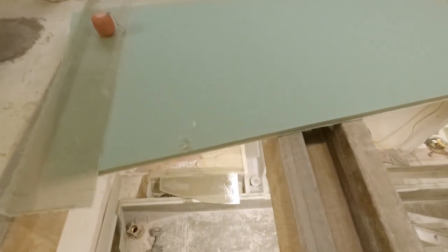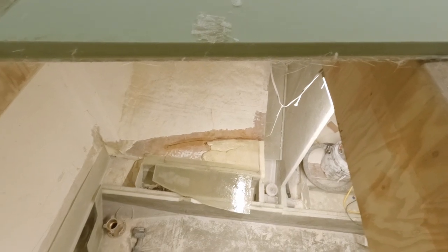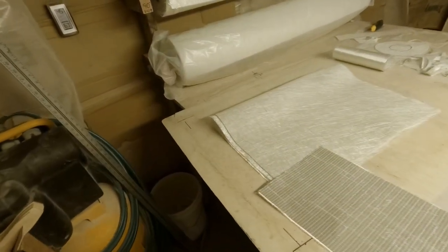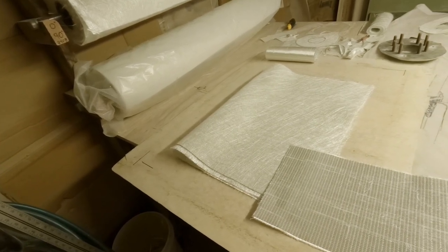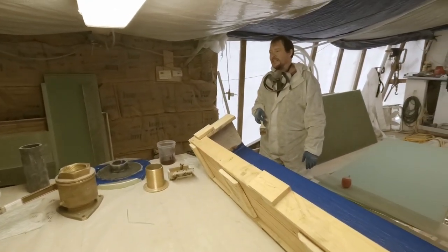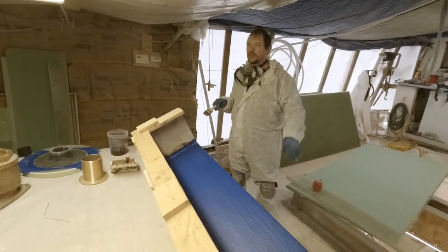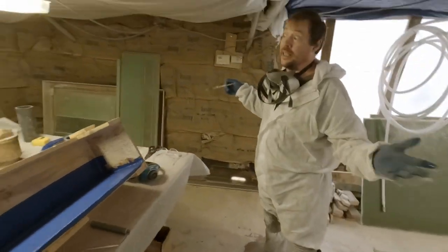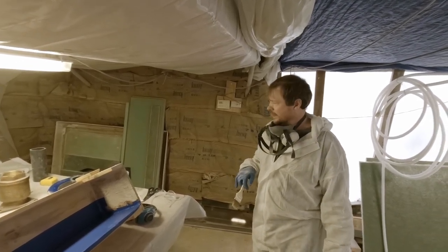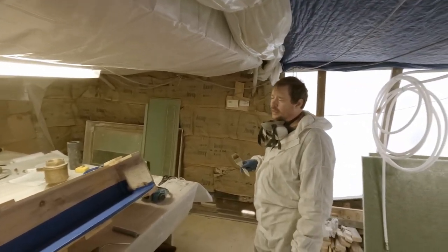Also going on down here, this is a flat piece of laminate that I laid up yesterday on this chunk of, I think it's just shower wall plastic. I had thrown a layer of PVA on it. FRP, fiberglass reinforced plastic. The backside is fairly smooth, the other side's got that really ripply, corrugated look. You see it in bathroom stalls everywhere. The backside worked out real good. It was smooth enough. Released really easy. One layer of PVA, and actually the PVA stayed on it, so I didn't even have to recoat it or anything. Which is pretty cool.